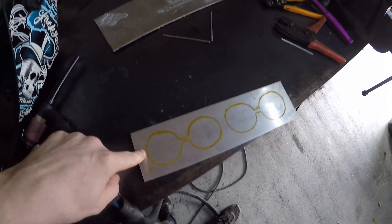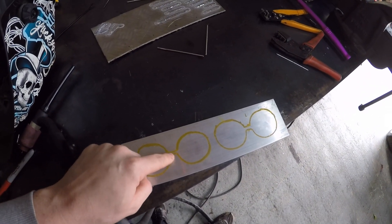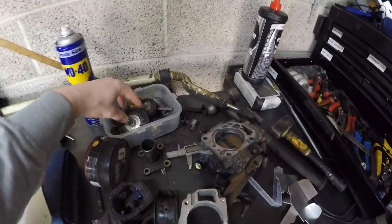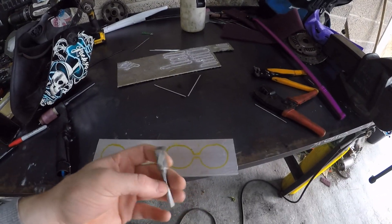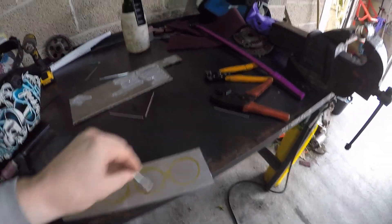As you can see, these holes are roughly drilled out. What I'm actually going to do — and this is the rough bit — is drill right the way around here in ovals, millions of holes, chisel it out. I did buy a carbide bit for aluminium. It's not like steel — steel ones clog up really quick. So this one is dedicated for aluminium, which will help me open that out. So, here we go.